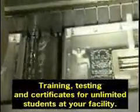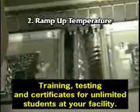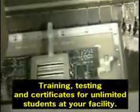Second, faster soldering speeds are made possible by raising the temperature of the assembly closer to soldering temperature. If there was no preheating, all of the required heat would have to come from the solder wave. This means the assembly would have to spend more time in the wave, or the solder would have to be at a very high temperature. The extreme temperature spike from room temperature to the soldering temperature could also damage the components.